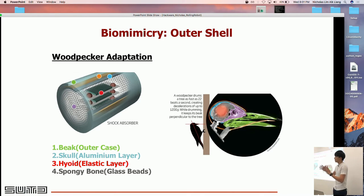The inspiration for the protective shell is biomimetic — we didn't want to over-engineer it, so we looked to nature, specifically the woodpecker. The woodpecker can tunnel through tree trunks with ease and remains completely protected, because it has four layers of protection in its skull. We mimicked this in our design: the outer case is a solid layer, then there's a metallic layer, and each layer has a specific purpose — essentially, we were making our own composite.